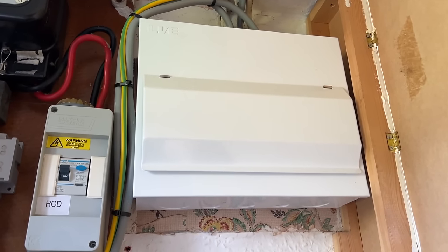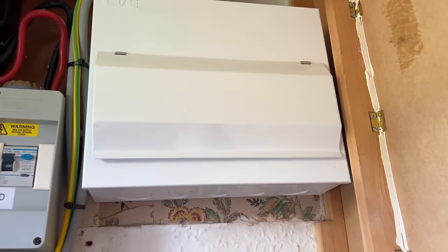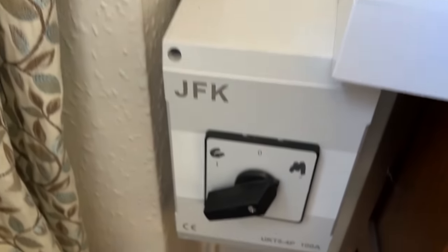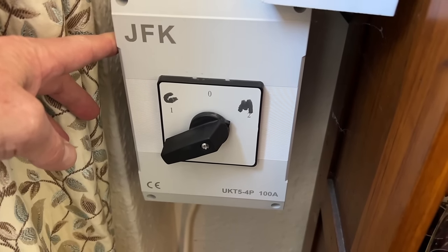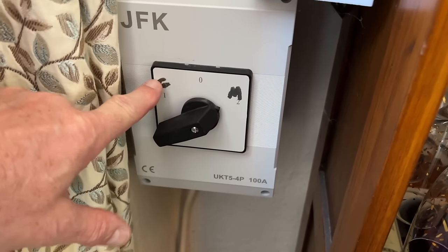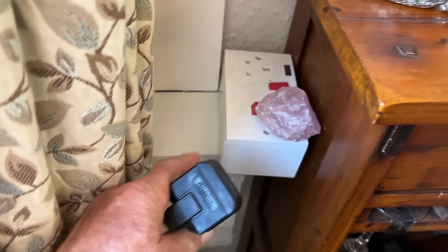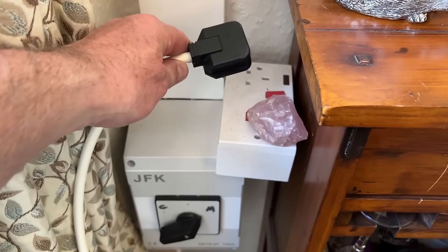For those who haven't seen our videos before, this is our fuse box for the cottage. We live in a 200-year-old cottage in the middle of the North York Moors on top of a hill, and we always get power cuts. These cables come down to this transfer box — it's a really straightforward and easy way to get off-grid power through your house system. We can have it on mains power, switch it off, or onto generator, and at the bottom there's just the plug. I've put an extension lead here that runs around the back of the sofa, and I plug this in here and then plug the extension lead into the power pack.